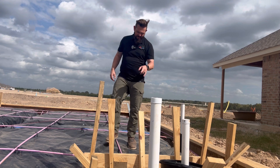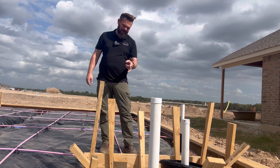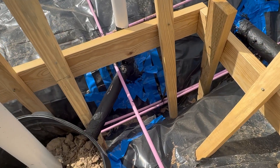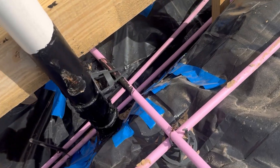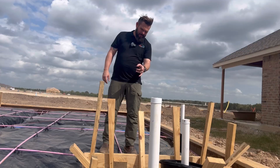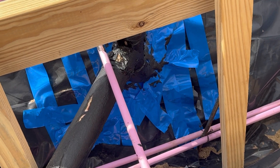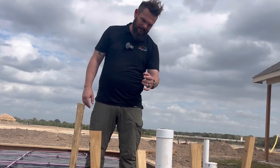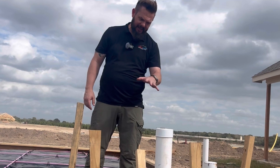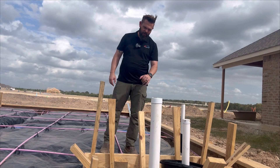What we have right here is a post-tension cable that's basically in contact with the shower drain. It doesn't need to be in contact with that form board. You can see they have a post-tension chair on one side where this vent pipe is, and I'm not sure how they're going to bridge this gap between the plumbing pipe, the drain pipe, and the form board. But it needs to be in between there — it's almost as if they set the drain too high. Either way, this needs to be addressed because that cable definitely needs to be pulled off that pipe.